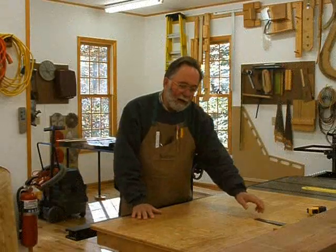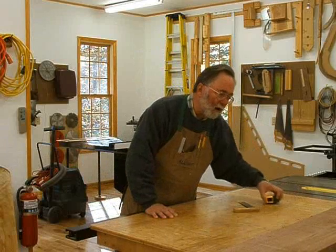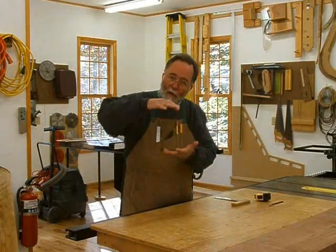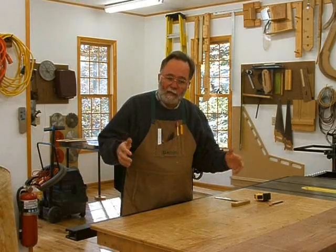Okay, now that you've had a chance to see those photographs and see those supporting beams that I talked about that will hold the mantle up, and the caliper that will measure the width of the fireplace and any angular difference from 90 degrees on the ends, the next step is to make these walnut vertical supports that go between the top and the bottom planks in the mantle.